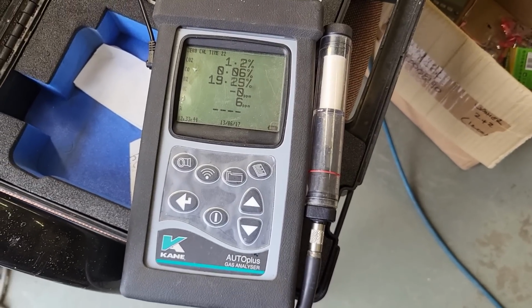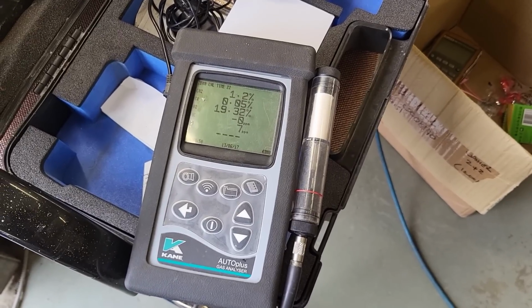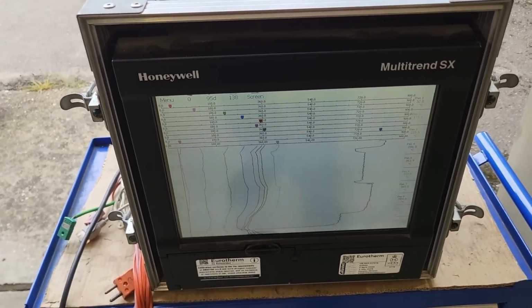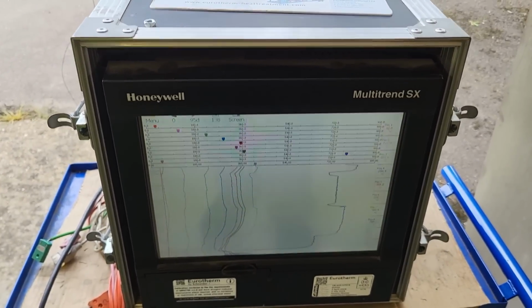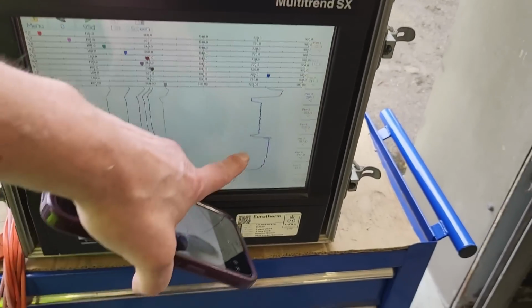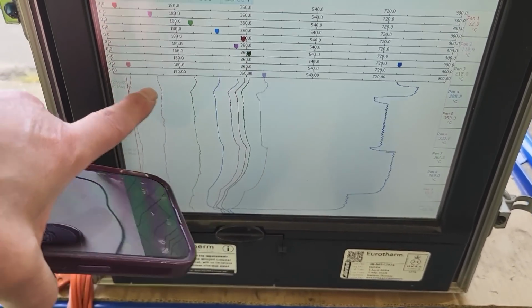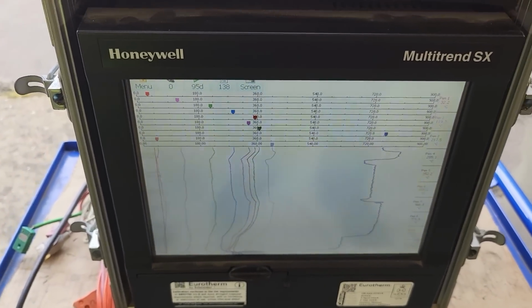That's gone worse, but the temperature's gone up. This is why what we want to do is get an oxygen and gas meter feed and get that onto a chart recorder, so we've got every single parameter in sympathy on a chart all at the same time. And there we go. Shut the bubbler valve a little bit. Temperature's coming straight back down again. But higher than this one. Yeah, it's probably going to settle about the same. But these have all gone up. And they'll presumably fall back a bit. Let's give it a couple more minutes to see where we get to.